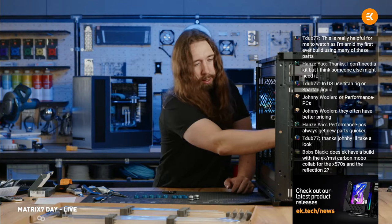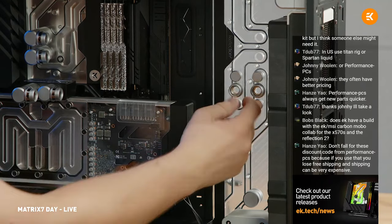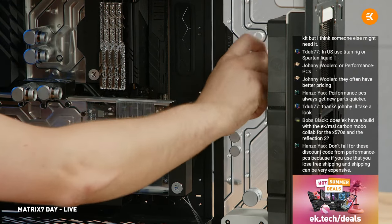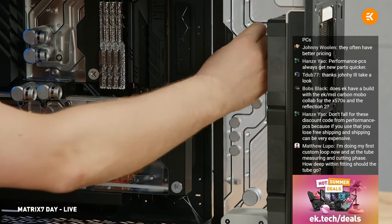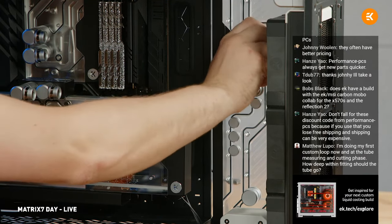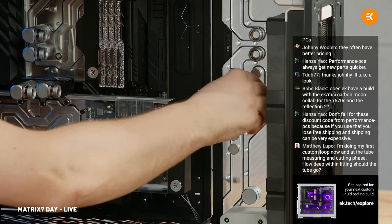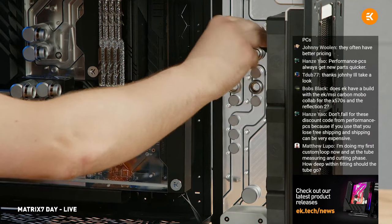You can see now at the front where I'm putting the HDCs between the micro plugs, you really don't have space for a bigger plug there. The plug with badge or the full size torque plug, there's no way it would fit without hitting the HDC fittings. And these are just 14, so the 16s are even bigger still, and the 16s will fit with a fraction of a millimeter to spare in this case, but everything fits next to the micro, so there's no worries about selecting a combination that won't fit.